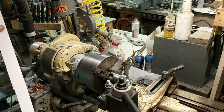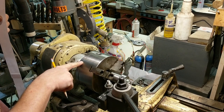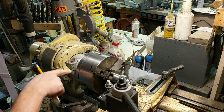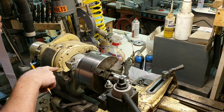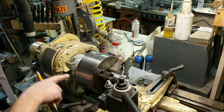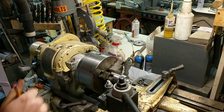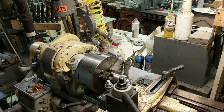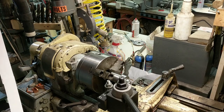These lines are the length of printer paper, so I'll have to print two or three series and tape them over top of one another, then tape that onto the chuck. I'll build a little sheet metal pointer, probably attaching it to these screws, so I have a pointer right here and can click the chuck through a hundred graduations — easy as can be. And of course it's not limited to a hundred; it works for any division you need.